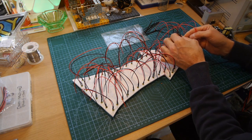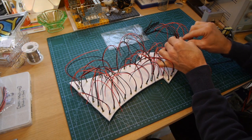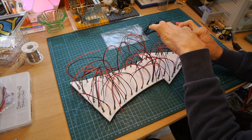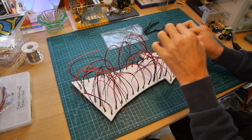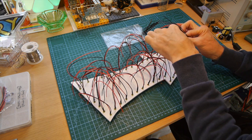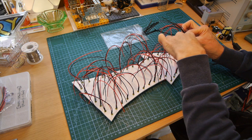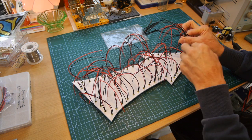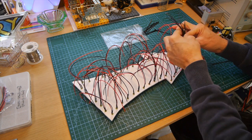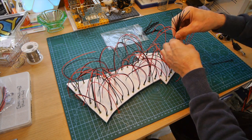So it was now time to coax the LED wiring into some kind of order. I hadn't really thought this bit out in any detail, but it seems sensible to group polarities together, starting with the common anodes and cable tie them together. This produced 3 groups of wires that could then be stripped, twisted together and soldered in bunches. I then joined the 3 bunches together to the common of all the LED positive wires.